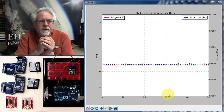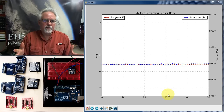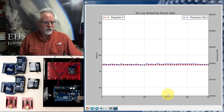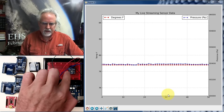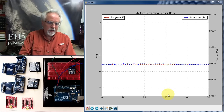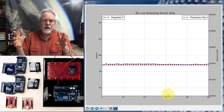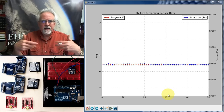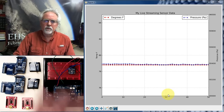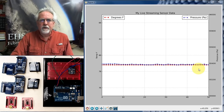Up until this point, we have put together a project that brings Python and Arduino together. To summarize where we are, we have a pressure sensor and a temperature sensor hooked up to the Arduino, sending data over the serial port, and then on the PC side we have a Python program that is reading in the data from the Arduino live and creating a live graph using matplotlib